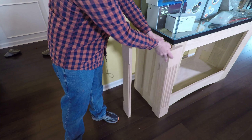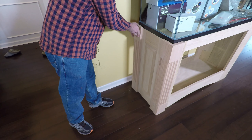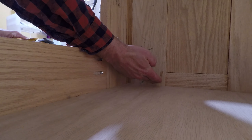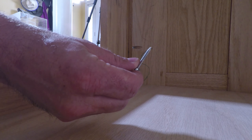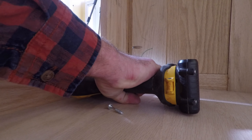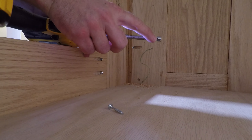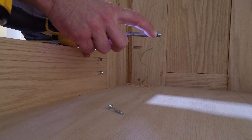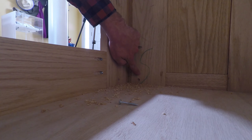These simply get attached to the face of the stand just like this. That'll make the attachments permanent. I'm going to drill small recessed holes here that'll allow me to thread a screw through the hole and into the column on the outside. In addition to that, I'll have glue on the column. In order to set the depth, I've basically tried to sink this shoulder to make sure that I don't go too deep. And I'll drill these holes both at the bottom and at the top.